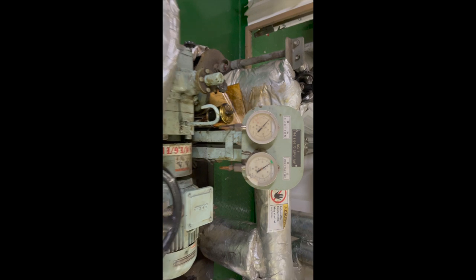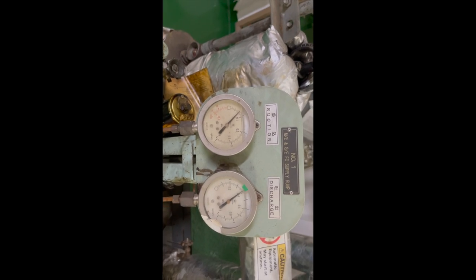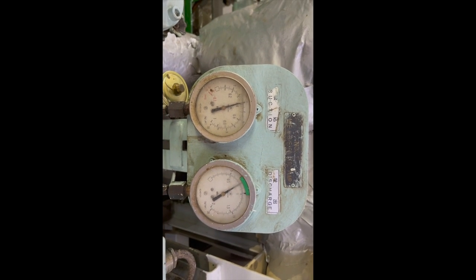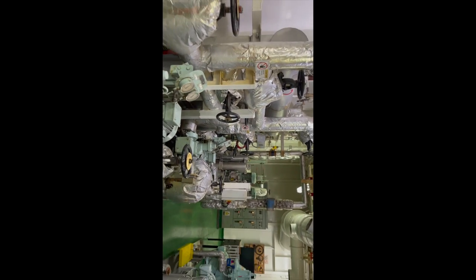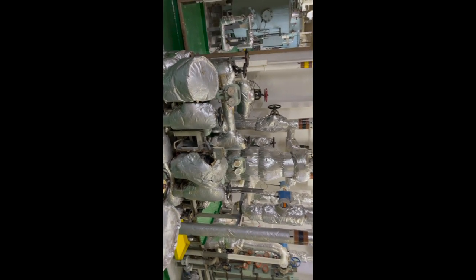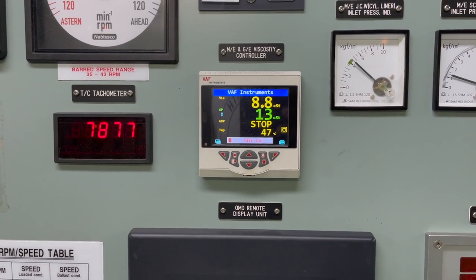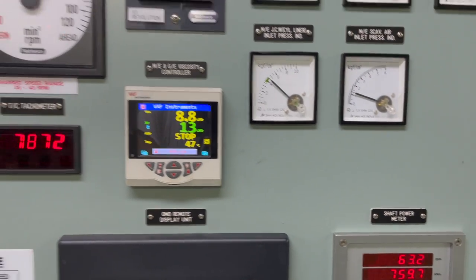Check the supply pump suction and discharge pressure. If you see any fluctuation, immediately do the opposite — open back the HSFO, confirm why it is fluctuating, and check the pump pressures again. Also check the circulating pump pressure. Always cross-check pump pressures because if a valve is stuck or you opened the wrong valve and there's no fuel supply, a blackout could happen. That is why I already started an additional generator on load with the MGO flushing pump.